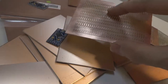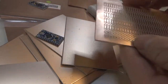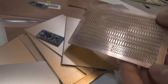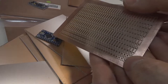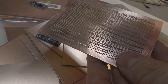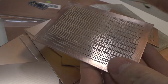So it almost kiboshed the whole thing. I could have used one of the protoboards I have, but I thought it would be really cool to show people we did it ourselves and it's purpose-built. The protoboards that are kind of breadboard style you can get from Adafruit and others. So I thought I would just go ahead and engrave this. Typical ways to do this: you could get a PCB engraver, I have a CNC machine — same difference but much bigger — and some kind of EDA tool that exports to G-code or DXF.